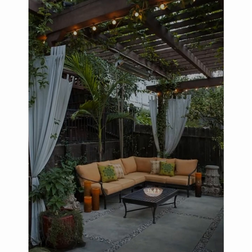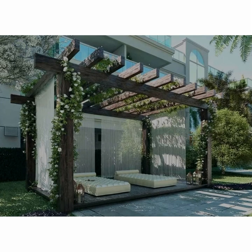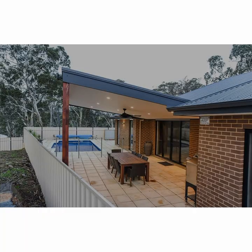Step 4 — Set posts in concrete. As you dig your holes, put the soil in a wheelbarrow and find a place to relocate it away from your site. Save any gravel or sand to reinstall pavers. You may need to move a post slightly — we shifted one post near the house to create an entry along the steps. Reconnect your layout string to make sure the holes are aligned. Cut your forming tubes and insert them into the holes, leveling the tops flush with the patio surface. If you mix concrete on site, you'll need about 5 bags of concrete mix per hole, for a total of 30 bags.